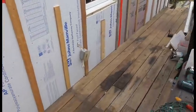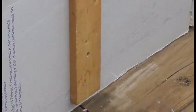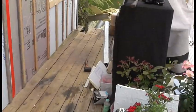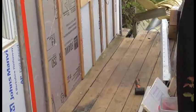It's basically done. Now if you noticed, because I'm going over the deck here, I have each one of those off the deck. I don't want them touching the deck and risk them rotting out. So, starter strip. You can see the starter strips right there, so I'm going to install a starter strip.